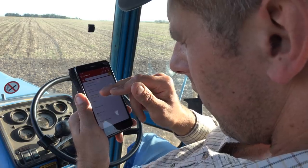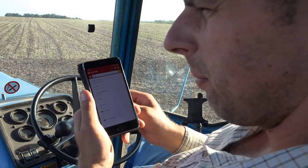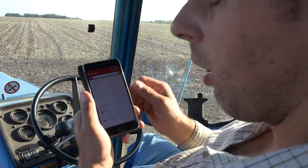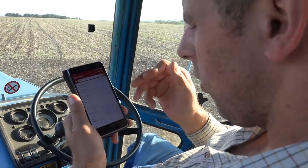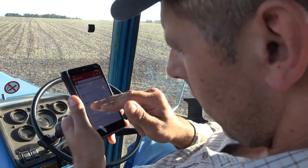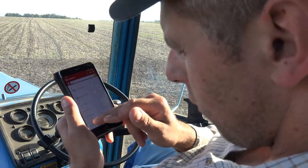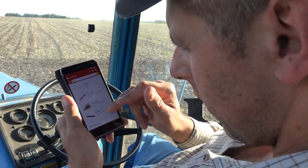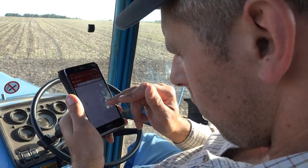Let me give you all the details. M36, that's the application. The tractor is up to 135 kilowatt - so what's the conversion, about 1.3 to 1.4 horsepower per kilowatt? So that's 180 to 190 horse - that's alright. Rod length 510, minimum working length 730, maximum working length 930. Yoke head length 75, pitch of thread 3mm, hook head length 117. There are the alternatives, but that looks about spot on to me.